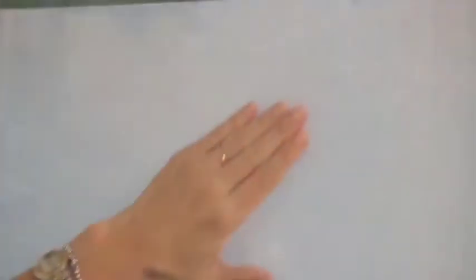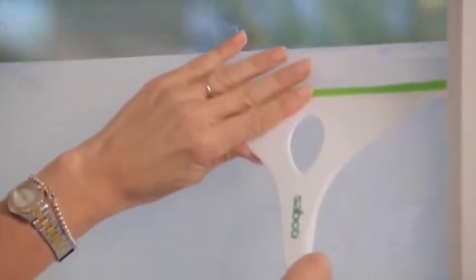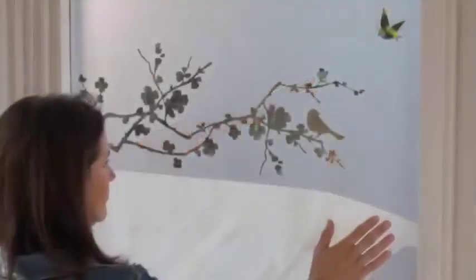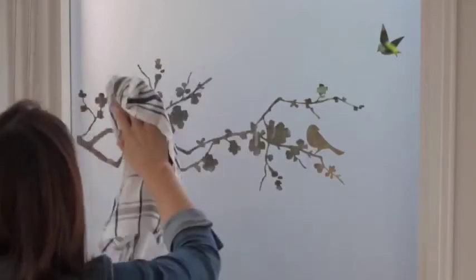You now need to leave the film for at least an hour. The time will depend upon the amount of water that's behind the film and also the temperature of the room. Come back in an hour and see if it's stuck. Spray the application paper with the water and detergent solution and carefully peel back the application paper from the glass, making sure the design remains stuck. Wipe the film dry and gently pat the design areas to make sure they stay in place.